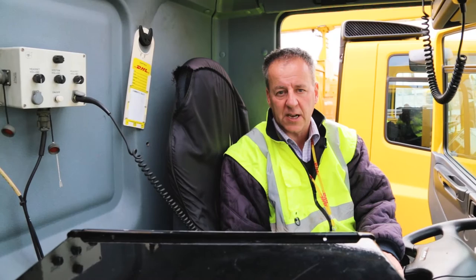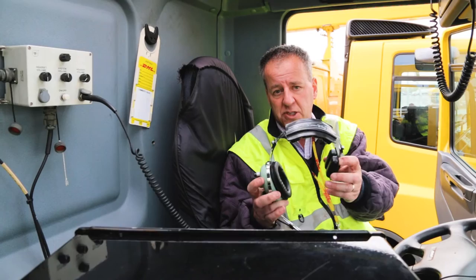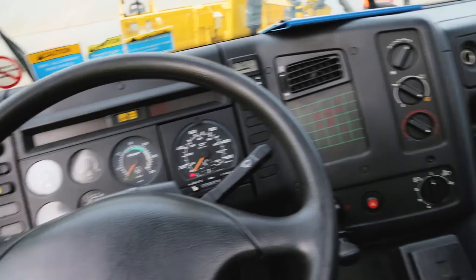Driving position. The driver will obviously be operating the controls, the heater controls. One important issue, as I mentioned earlier, is two-way communication. So there must always be two-way communication between the driver and the basket operator. Some of the key points here: before de-icing can commence, obviously the fluid has to be heated. So the heater controls are based within the cab.